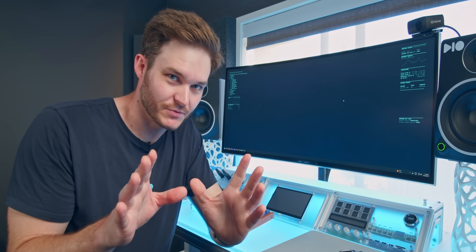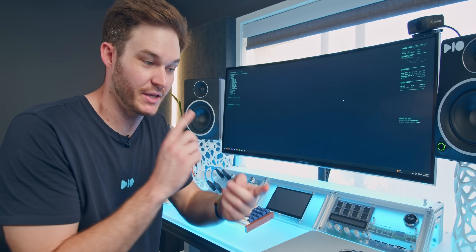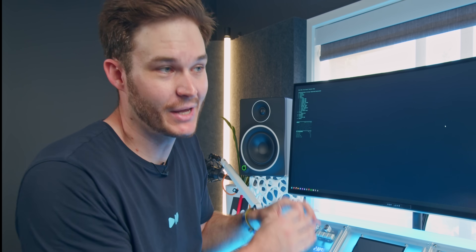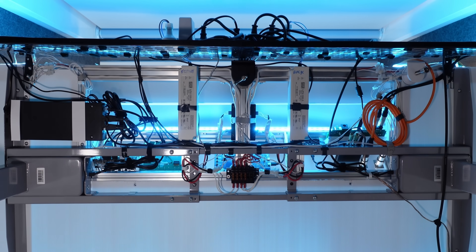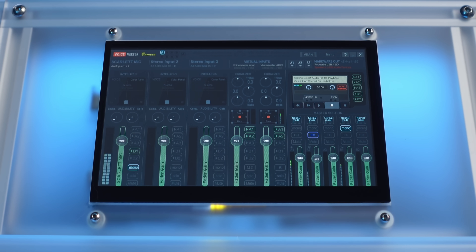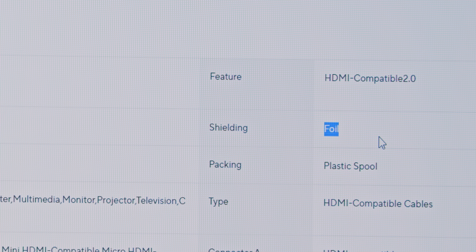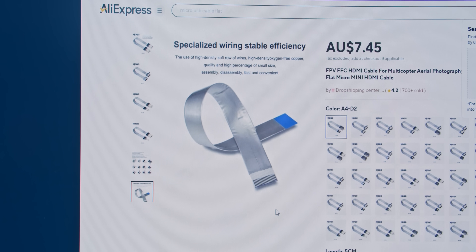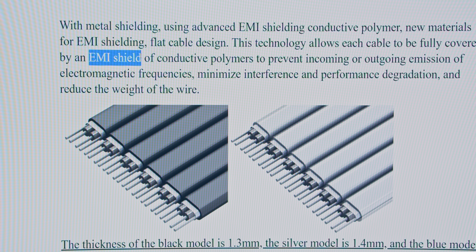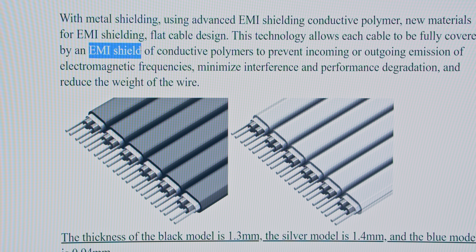The downsides of using a ribbon cable like this are that they're fragile and don't like being moved around a lot. Plus, this one in particular has no shielding. My desk has a lot of electronics shooting electromagnetic interference everywhere, and I have no signal issues — it's completely fine. But if you do have issues, you can get foil shielded cables for the modular HDMI version 1.4 variety. HDMI 2.1 versions I've seen also have shielding on the wires.